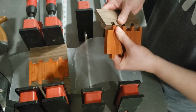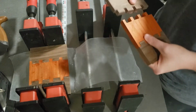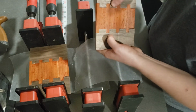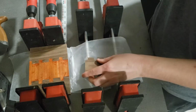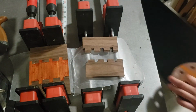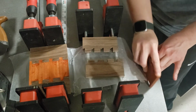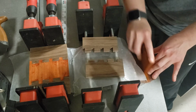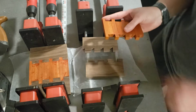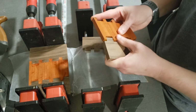So when I line up the second one here, the first one fits nice and tight. And then when I line up the next board, I notice that there's a little bit of a gap. And you see that gap? That's going to be a problem because that has to be strong enough to withstand the router going through that joint again. So that piece of walnut was maybe just a hair high when it was going through its cut. So just by sanding down this a little bit, I'm going to be able to get a nice tight fit.